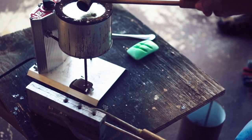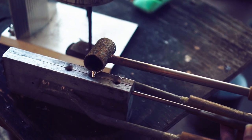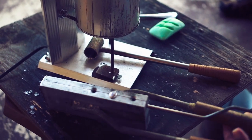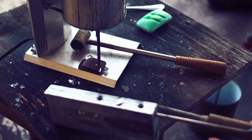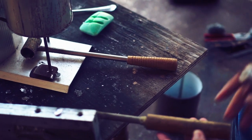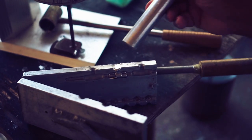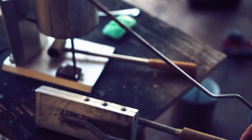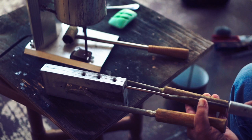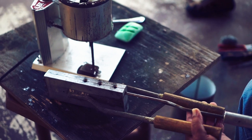Now what we're going to do — I'm just going to pull one. See, it's not hot enough. You can tell. Right away you want to run it through a little soap — it puts a coating on there. See, the sinker didn't form because it's not hot enough yet; the mold's not hot. The lead's okay, but the mold is simply not hot enough — the mold's cooling off the lead too quick. But as you keep pouring, the mold gets warmer and warmer and the form will get better.